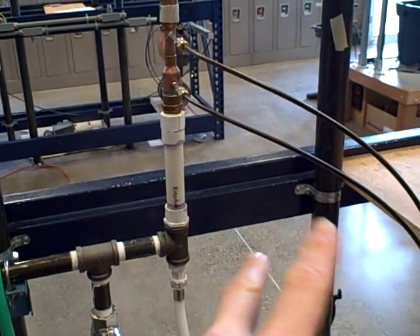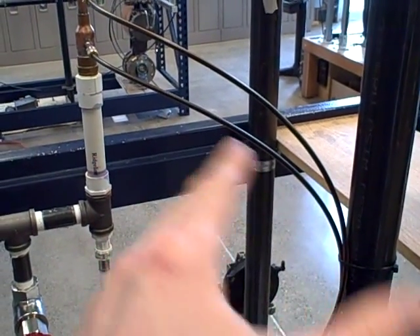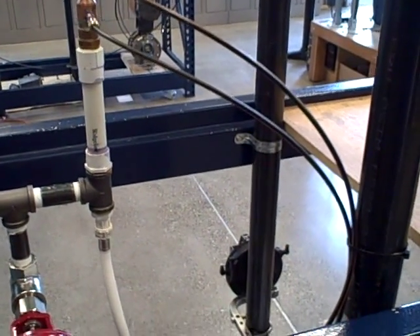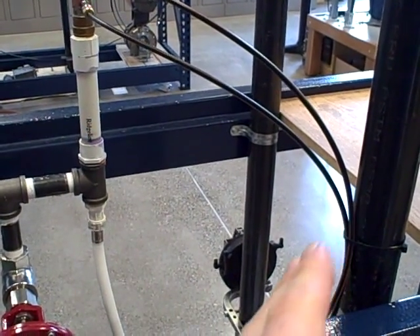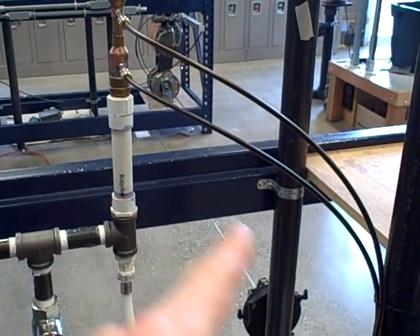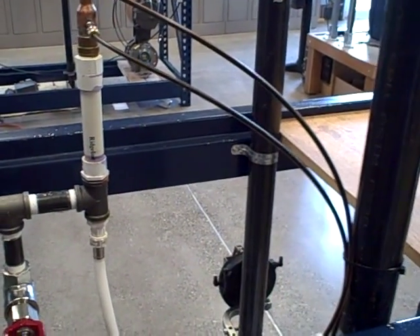That vertical height elevation creates a hydrostatic pressure with these liquid-filled tubes, and if there's any air in those tubes you tend to have a difference in the hydrostatic pressure from one tube to another that is not attributed to flow but rather simply to the elevation difference — the hydrostatic pressure difference of those two water columns.